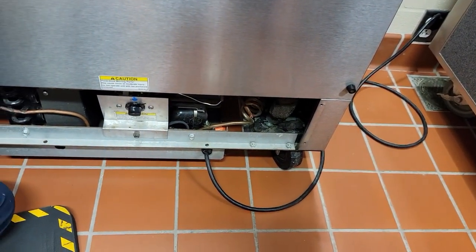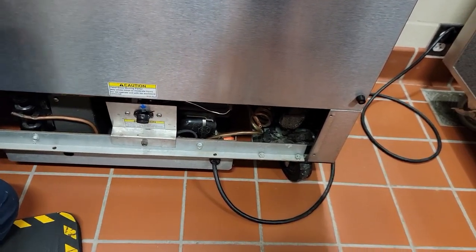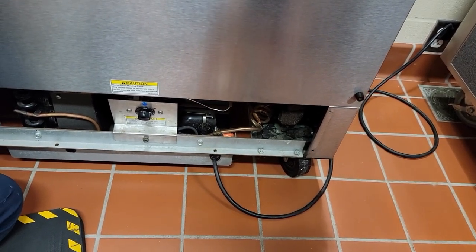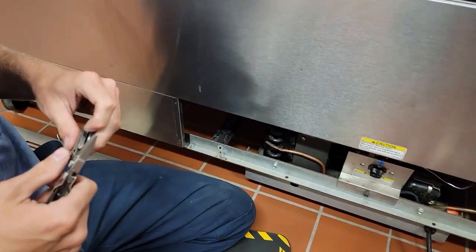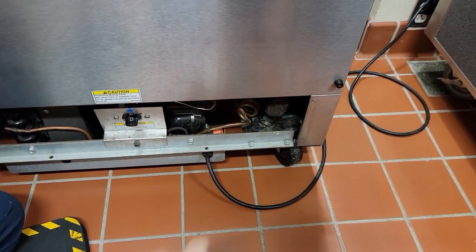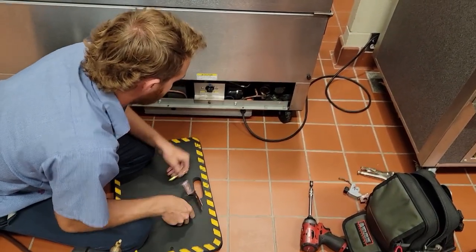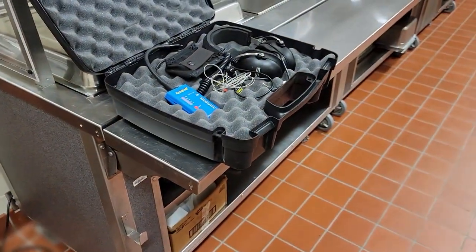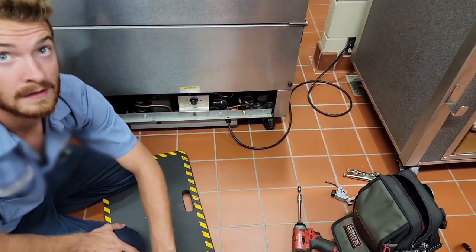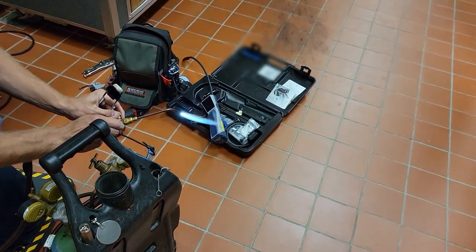You got to use it to make a pond - stay full so it doesn't leak and it takes a ton of it. That looks pretty good. You probably don't have a reamer in that bag - what do you need a reamer for? We're just going to hook that thing on the outside anyway so it's not a huge deal. We're going to get this thing tapped on there, do a pressure test, and see if we can find the leak with the ultrasonic. Chances are it might be in the wall. If that's the case there's not a whole lot you can do about it.